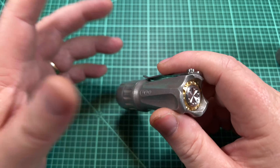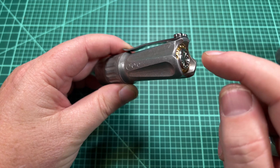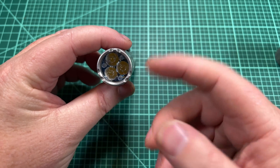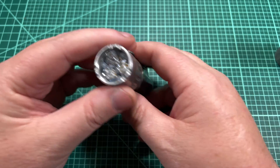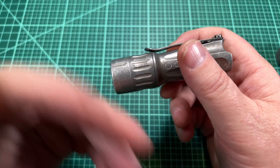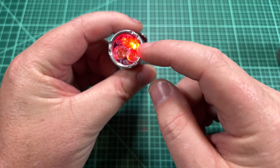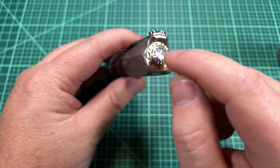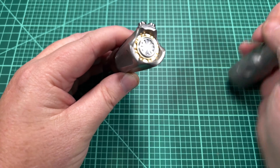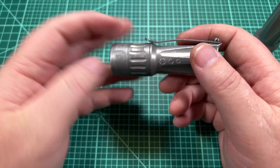One of the last two reasons to turn to the MoFF: since it's always on until you press it, you have the ability to have a beacon locator — the kind of feature available on e-switch lights. Like Hank lights with auxiliary lights that flash so if you drop the light into tall weeds while hiking you can find it — now you've got that ability on a Boss as well. The MoFF is really combining two worlds: clickies with e-switches. It's still a clicky and still disconnects from power, but being always-on means you can do e-switch-style things with the driver.